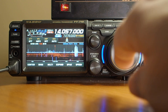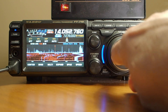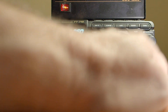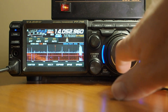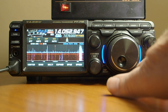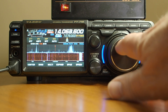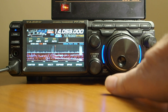Like any radio, you move the VFO knob and you can select your exact frequency. To the lower right of the VFO knob is a fine or fast button. If you just tap it once, it goes into fine mode — that's really good for CW, for setting that exact frequency. Tap it again and it goes off. If you hold it for a second, that goes into fast mode and now you have a lot more authority when you move the VFO knob. Tap it again to get out of that mode.